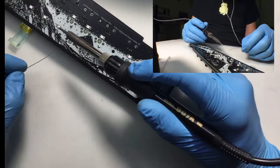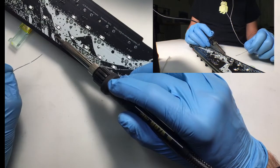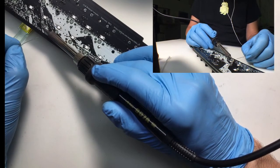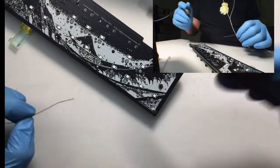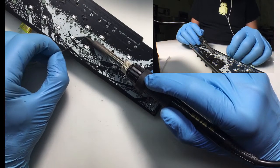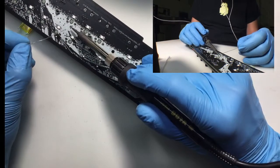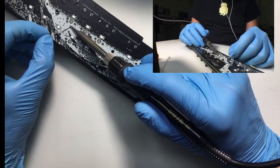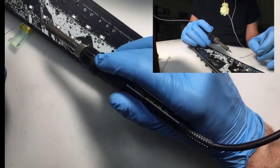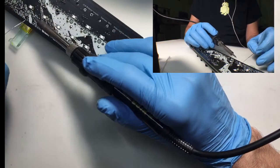Had that moment of, did I test all the switch contacts? I think I did in the other video, but if I didn't, it really helps to go through and test each individual switch contact before you do the soldering business, just in case a diode isn't working or something like that. I think I mentioned this in the previous video, but good to do with some tweezers or a piece of wire ahead of time, because if you screw something up at this stage, you're gonna have to desolder all of these switches, which is not really fun to do, I think. It's just a lot of solder sucker action. They're actually pretty easy to undo compared to some things anyway.